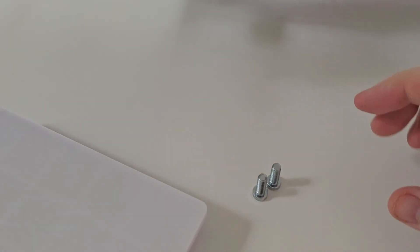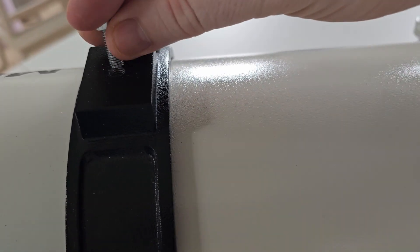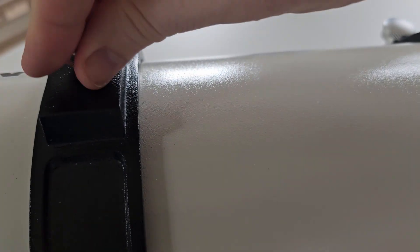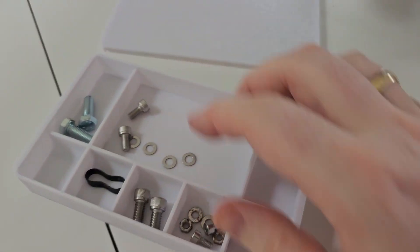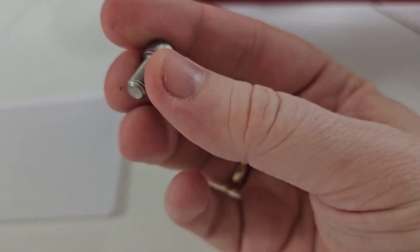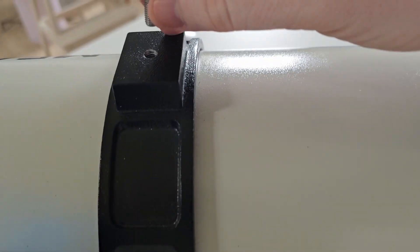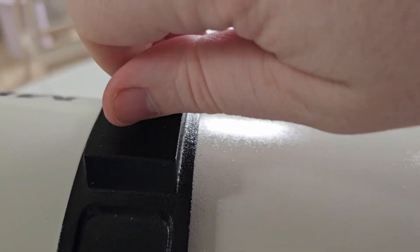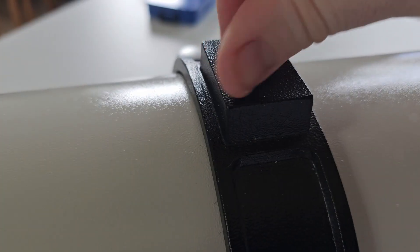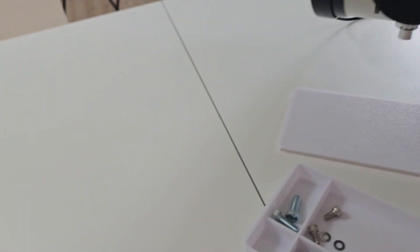I need to talk to you because I feel like I'm losing my mind here. So I know how we started with these threads - we got bolts. I went out and I got bolts and these bolts, they kind of fit but not really. Then I thought, ah, this is just because these are imperial thread. So I sourced imperial threads - you don't know how hard it is to find imperial threads in Europe with hex fittings. I had to go to a dedicated Harley store. But this one - it's almost there, but it's crooked and it's cross-threading and it doesn't really fit. I tried to force it a little bit but I could see it began to strip the threads. So those didn't fit.